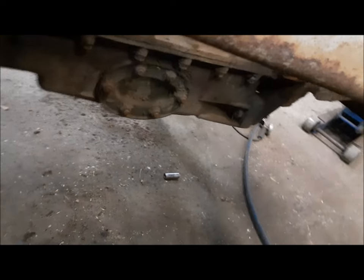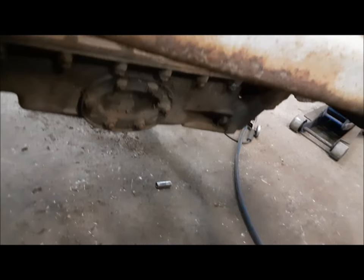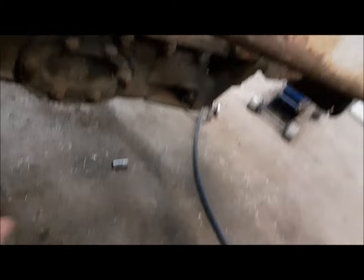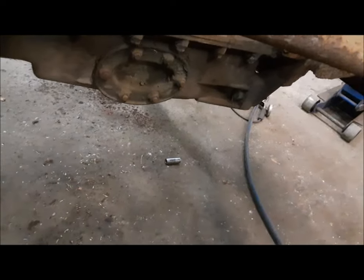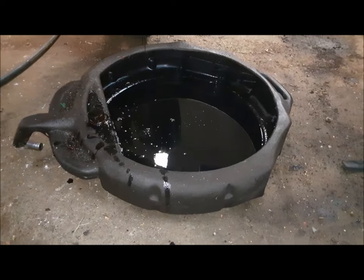What we're going to do now is give this baby a nice oil change and see what comes out of it. I don't think it's going to be too pretty — that's for sure. I've pulled the dipstick out and looked at it a couple of times. Once it's empty we'll pull this pickup screen, clean it, and put it back in.